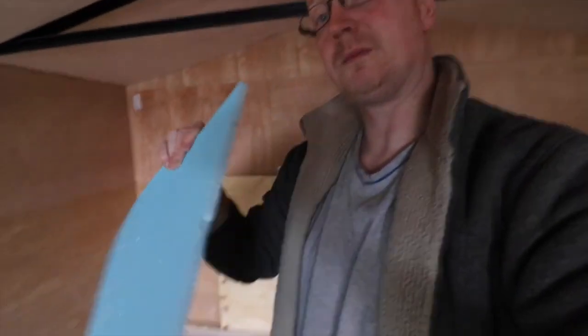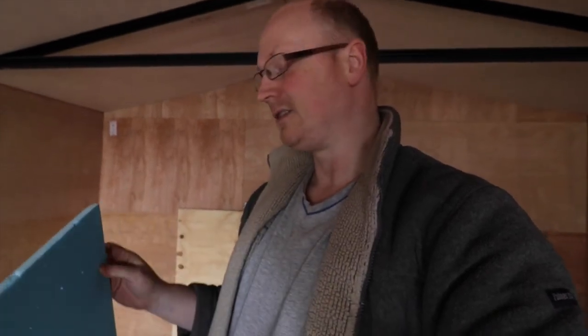So as you can see, it's quite important that you insulate the floor, because it's going to be cold concrete and we need to have something as a barrier to keep the room warm. So I'm using two types of board. This is XPS foam. It's very similar to a polystyrene hard board. It's very dense and very hard and it snaps easily.